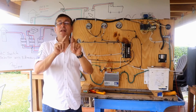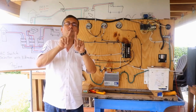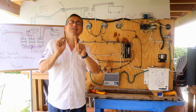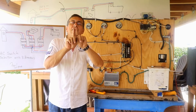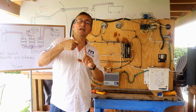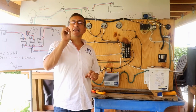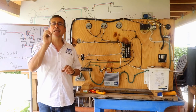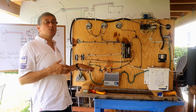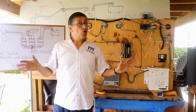When you have two dissimilar metals together in a marine environment, you have galvanic corrosion. Additionally, if you have extra current passing through those metals, the corrosion is accelerated — especially if there is humidity between them. The more noble metals attack and destroy the less noble metals. For that reason, if the reverse polarity indicator light is on, you need to solve the problem immediately. Otherwise, your bonding bus bar is now powered with AC — 120 or 240 volts.